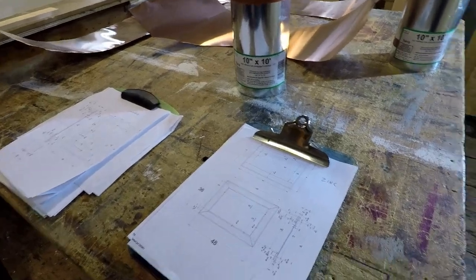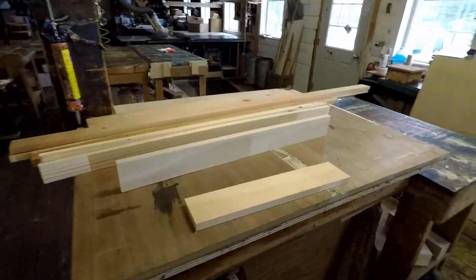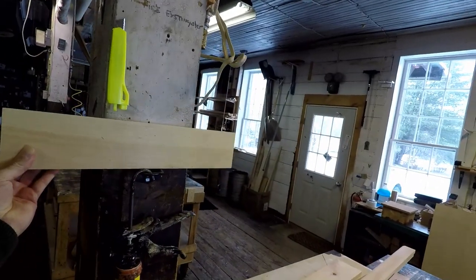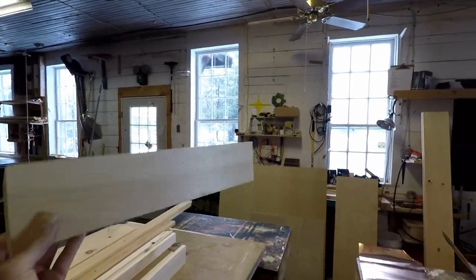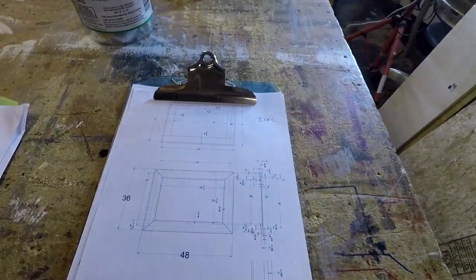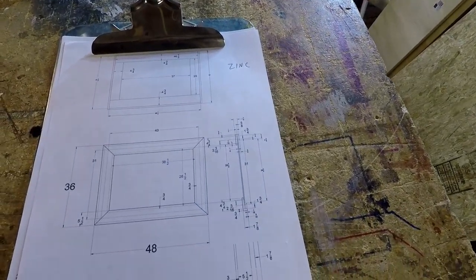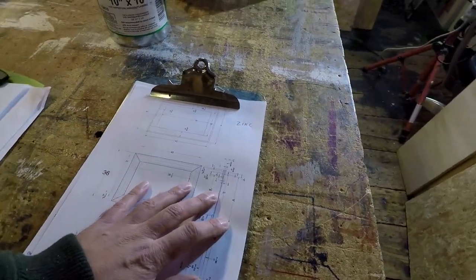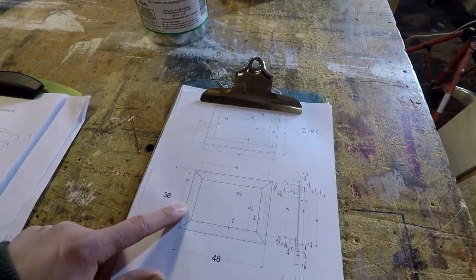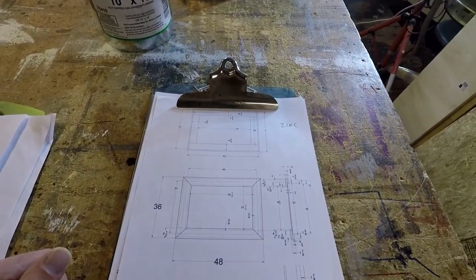And for hanging the mirrors, I always do a French cleat mounting system. And that involves a hanging cleat with a 45-degree bevel rip like this. And so this would hang up against the wall, and the mirror would kind of sit on top of that and wedge itself against the wall at the same time. And it's a very easy way to install the mirror. It's much better than the wire mounts or the hanging brackets, those little metal clips. So I always do the French mount system, and I do the 45 cleat around the entire inside perimeter of the frame. So you can hang the frame horizontal, vertical, or any which way for more versatility.